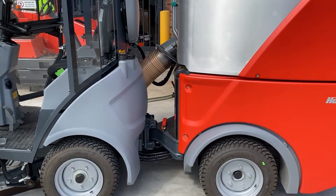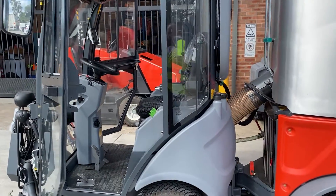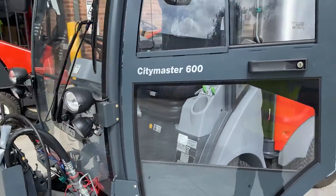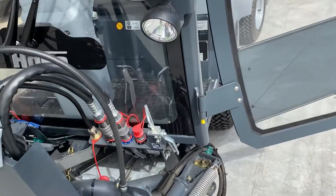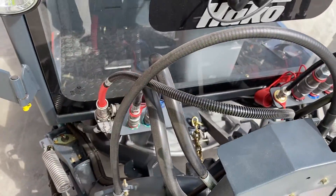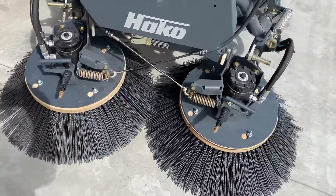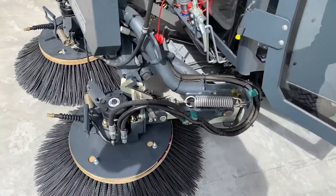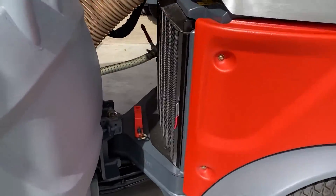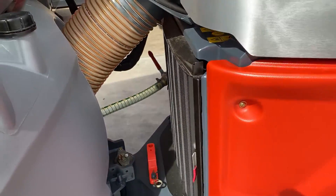The unit is permanent four-wheel drive, so there isn't a gradient I've ever seen that it cannot climb — it can literally climb a ski ramp. On the front end there are quick-connect and disconnect fittings for all hydraulics and functions, so adding a mowing attachment requires no tools, and removing the front end also requires no tools. The radiator is quite large so you'll never have issues even in high-temperature environments.